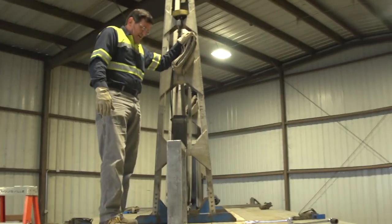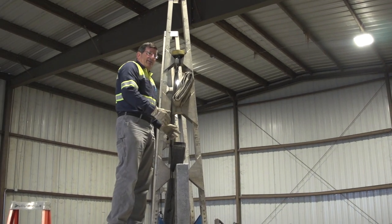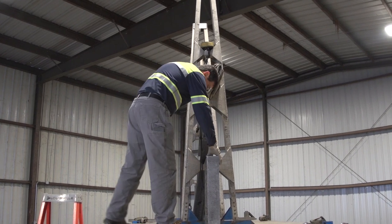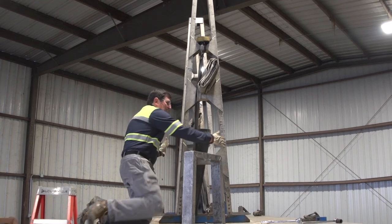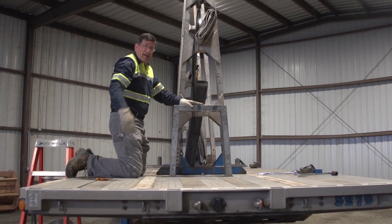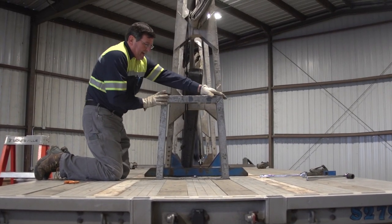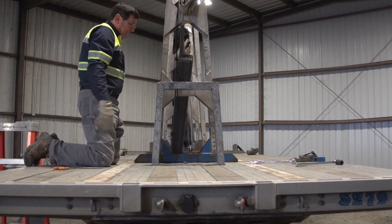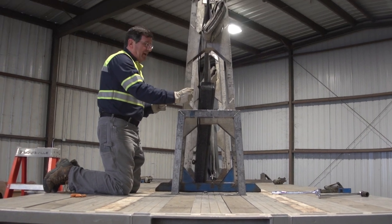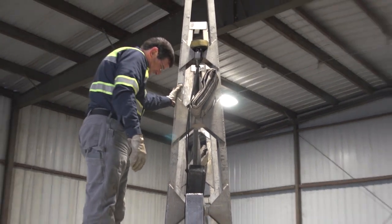These mini A's are offset — they're offset for the ease of going into glass. You don't deploy your mini A's until you have glass on both sides of this rack. If I turn this this way, the sides of this are supposed to mimic the sides of the apron — and as you can see, I am not lined up. That's the wrong way. If you turn it such, that's when it lines up. They're offset purposefully to make it easier for them to slide into the glass when you have glass on them. They ride into the glass plant like this.